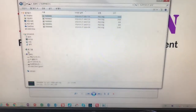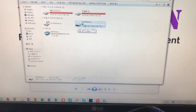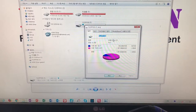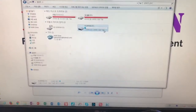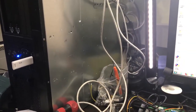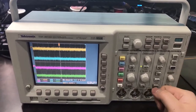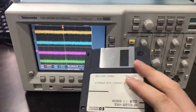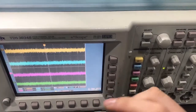You also have to modify your USB stick. This one is converted from FAT32 or NTFS to FAT format, and it's an 8-gigabyte USB stick that's been reduced down to 1.4 megabytes. The scope will recognize that USB stick as a floppy disk, but for users it's much easier than using an actual floppy disk. All you have to do is install the converter into the scope and modify your USB stick.